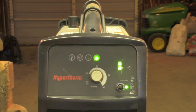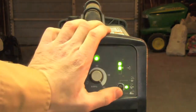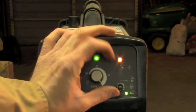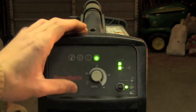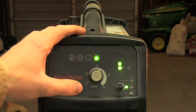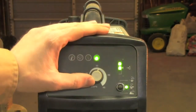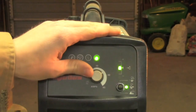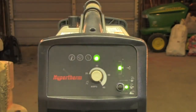Lights start coming on all over the place. As you can see we're already set to its regular plate cutting mode. We have our expanded cutting metal mode, our regular plate mode, and then the gouging mode down here. Our airflow might be just a little bit high, so I'm going to turn this down past 20 amps — that'll get the air going so we can have an accurate reading — then adjust this regulator back here. And since we're putting it to the test, I'm just going to max out the amperage. Let's do it.